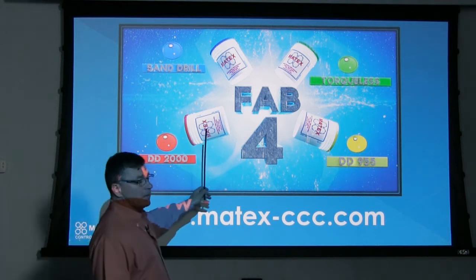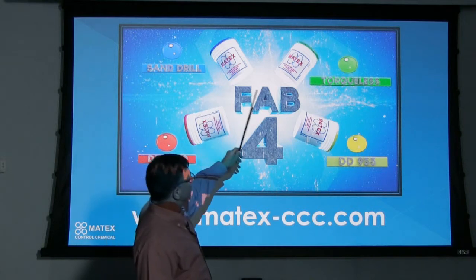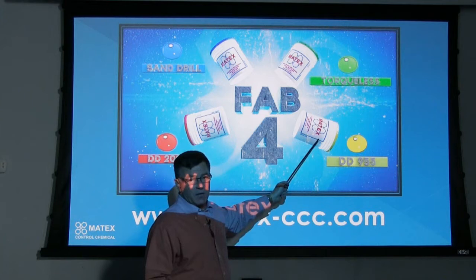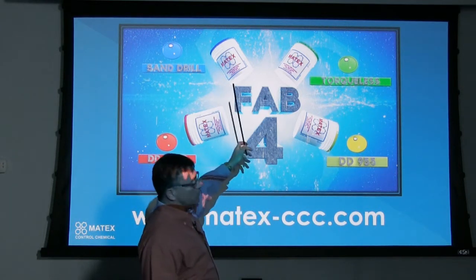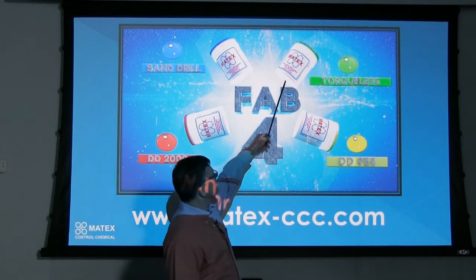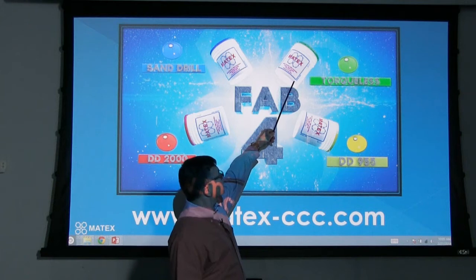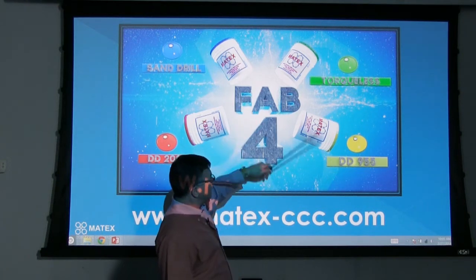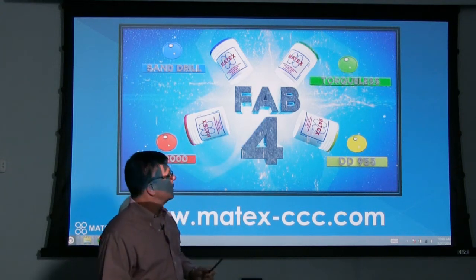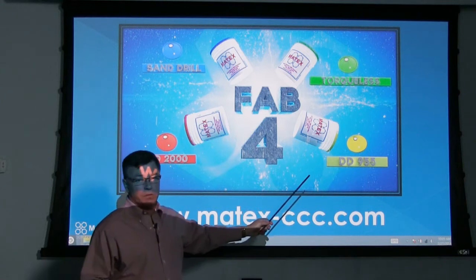We always talk about our Fab 4, which kind of came from some of the drillers in the field. They've labeled our Torqueless, Sand Drill, DD2000 and 955 as our Fab 4. We run with fairly simplified drilling fluid systems here. We usually use maybe 2 or 3 products at the most. One always starting with Torqueless, maybe mixed with Sand Drill. We'll throw a little 955 in there to look after any potential clay zones. And Xpand can be added to any one of these products.